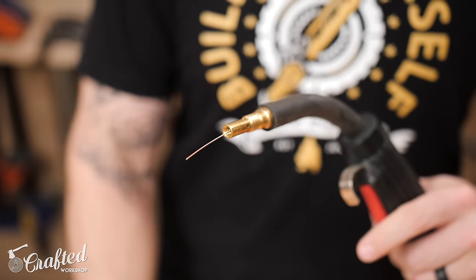The other tool is optional depending on your process: a chipping hammer, used to chip away the flux left behind when stick welding or flux core MIG welding. Every time you lay a bead with either of those processes, you're left with a layer of flux covering the weld bead — that flux shields the bead from impurities in the air. If you need to lay another bead in the same spot, you have to chip away all that flux or it gets worked into your puddle, which is bad. The chipping hammer is really cheap but you'll use it constantly with those processes.